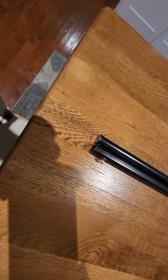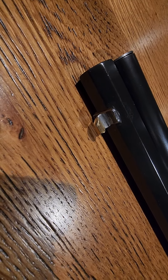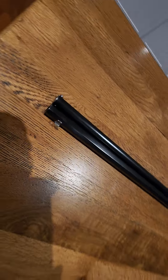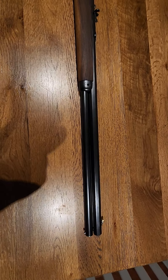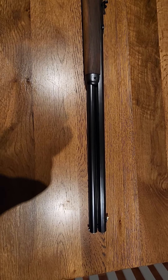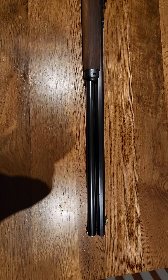I've even made my own little brass top sight there which I'm just in the middle of finishing off. I'm going to take a little bit more brass off it — it was actually bronze, not brass. I bronze welded a small amount of filler rod onto the top of the sight and filed it down into a shape, giving it a light polish. It's still a little bit too large — I'm going to make it a little bit smaller. It's kind of like a marble sight in that respect, with a little gold bead which I quite like.